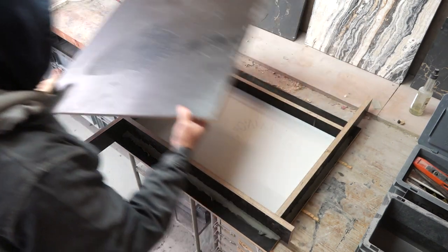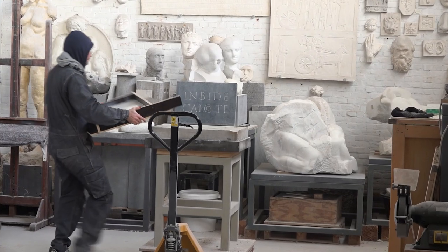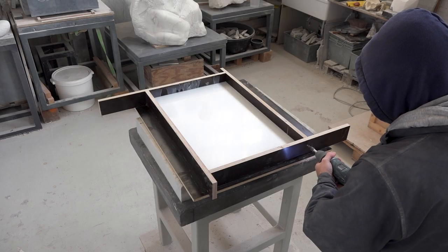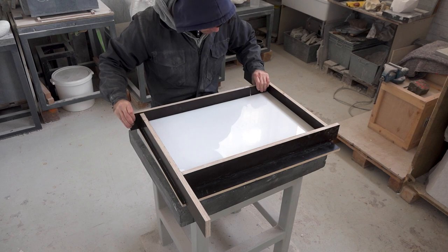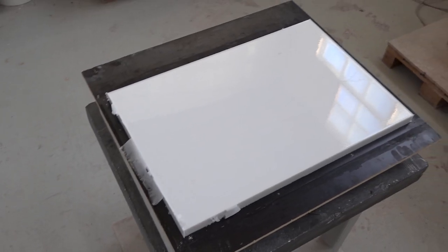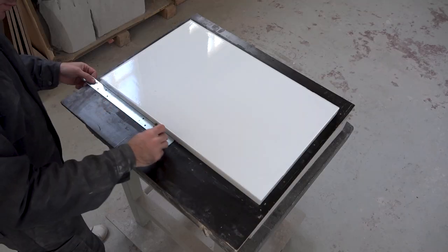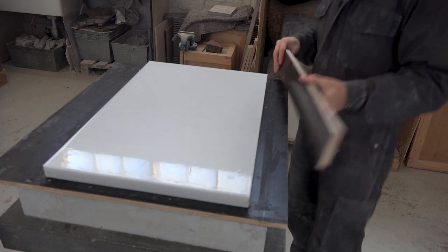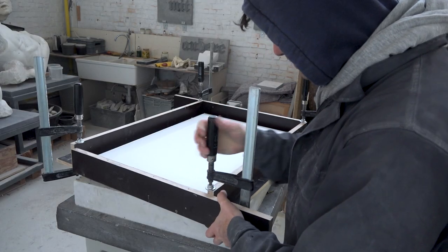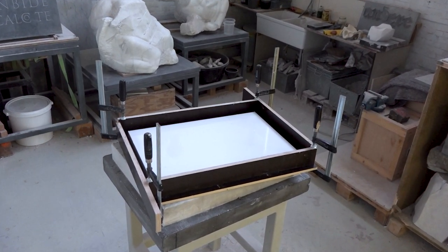The silicone should have fully solidified and reached a hard but flexible state. So it's time now to disassemble the wooden framework in order to replace this temporary structure with a plaster support for the silicone mold — what we call a counter mold. What you see me doing here is basically repeating the steps that I did for the silicone, assembling the plywood walls to create a pool where to pour in the liquid. Only instead of silicone, now I will pour the plaster.